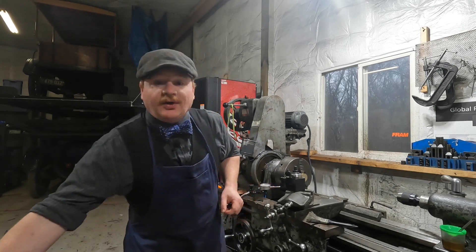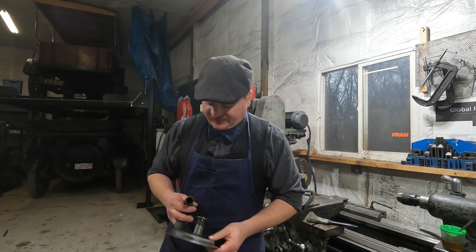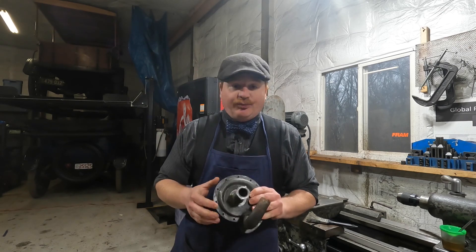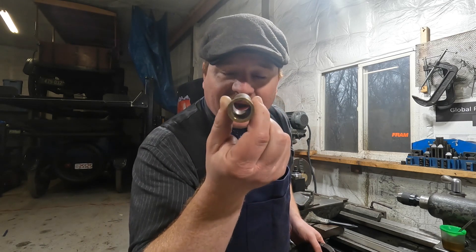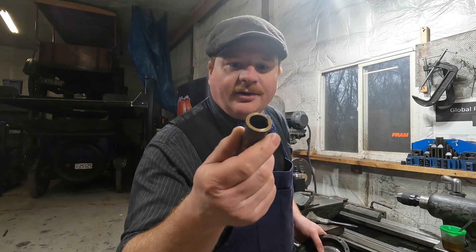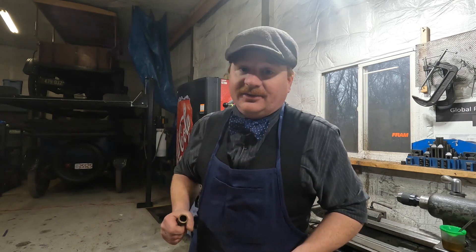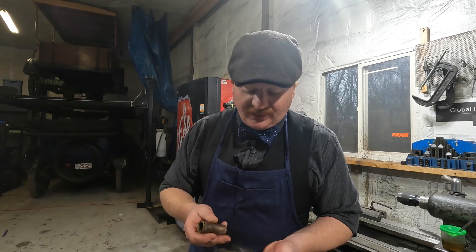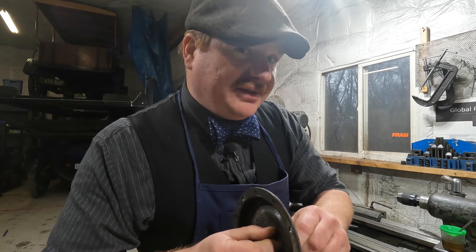Like I mentioned in the last video, you saw me extract the water pump in a little bit of stop motion action — the wonder of this modern technology in these cameras. I did crack the pump apart and show you the insides, but again, we're working on re-bushing this side of the pump. Off camera, because I'm on a bit of a deadline, I did get the old bushing extracted. It looks kind of something like this — not that complicated a piece to make. Standard bronze material, very common from back in the day. It was a bit of a devil to get out of here, though. I did have to apply a little bit of the heat wrench — also known as a torch — and some heavy-duty pressure from a hydraulic press. But normally it would slide into the assembly like this, and it is a press fit. That's why it's so tight.